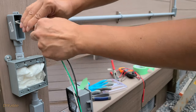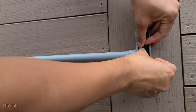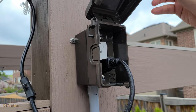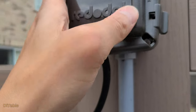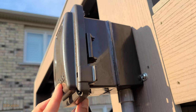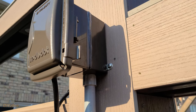Now we are going to push the wires through to the other side — there's no need to use the twine as the guide wire from here. For the elbow, here's a DIY tip: leave some slack and make a loop — this will give you a smooth transition. Something I want to share: this brand called Red Dot has very good waterproof covers, but I got the wrong one — it doesn't even close properly. You need to get the deeper version, which closes properly.